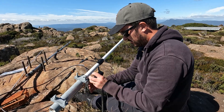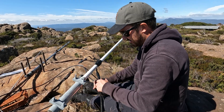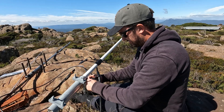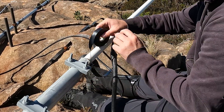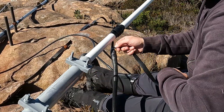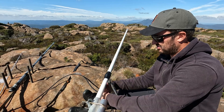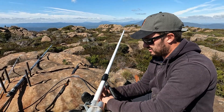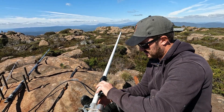And then work your way up the cable. I like to start a fair way behind the connector, just because if there's any kinks or any sort of cuts or anything, then they're going to be covered. So now we're going over the main end connector. Sometimes you get to this point and you can't quite fit it around, so you kind of have to feed it around like this and then sort of stretch it. Now we've done one layer — I usually like to come back the same way and do another layer, especially on sites like this where you get ice and snow. Capillary action with water just does weird things sometimes, and you get water in places where you thought you'd never get water in. So we'll go a second layer.